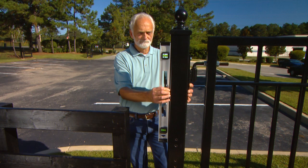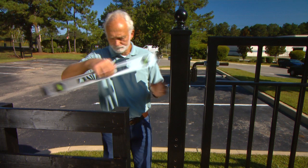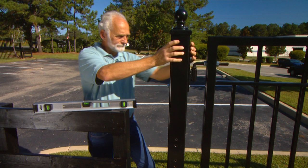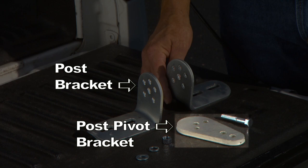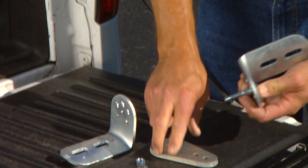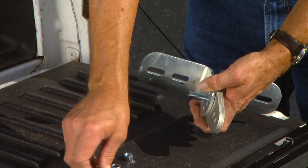Your gate should be installed on a fence post that is firmly secured in the ground. We recommend positioning the opener near mid-height of your gate. It may be necessary to add a horizontal or vertical cross member to provide a stable area where the post bracket assembly can be mounted. On round posts of 6 inches or larger, the post pivot bracket may not be necessary, allowing for the post bracket to be mounted by itself. In this demonstration, we will be using the post pivot bracket.